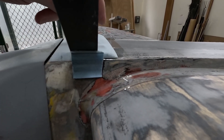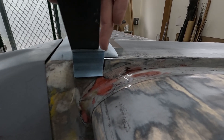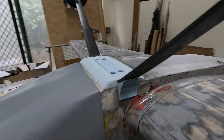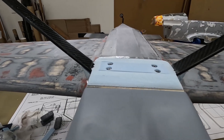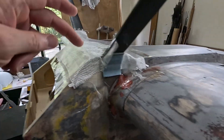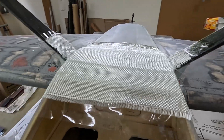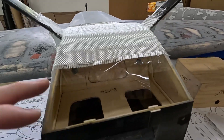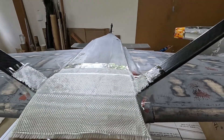I'm hoping that flexibility will be enough so this isn't going to be a problem. If it is a problem, I can always cut it back some, but I can't cut it back too much because I need this landing gear-to-fuselage fairing to come out to right about here. I finished up the foam plug, rounding it over the front and over the back as well. I put some spackling compound on it, smoothed it all out pretty well.